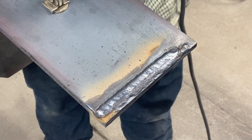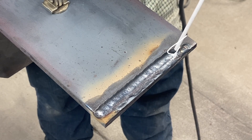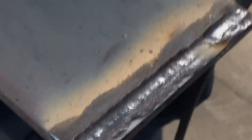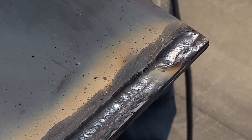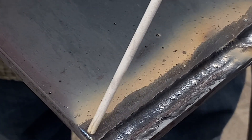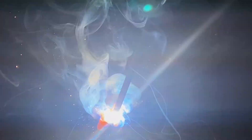I want to show you guys how to do a restart too. When we fire up, we're going to strike up up here, drag our rod back, swoop in, grab our puddle, and take off. That should give us a really nice restart. If you look closely, you can see the restart, but it's blended in really well. That's also how you fire up your 70-18s when you're just taking off. Even if you're not doing a restart and you're just firing up for your first pass — you strike up ahead of it, you drag back, you loop, you pause for a second, get your puddle started, then you take off.